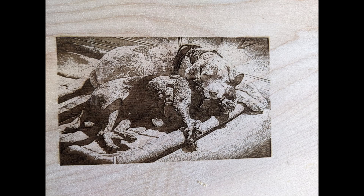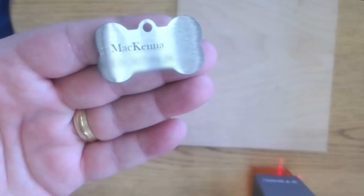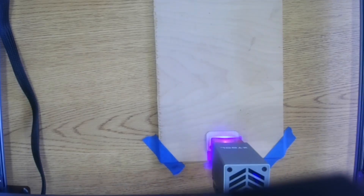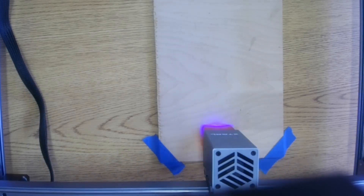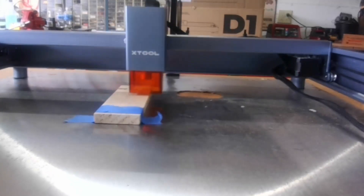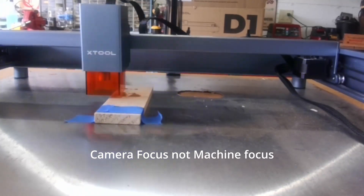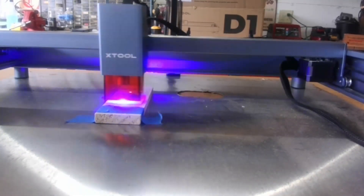You can see the amount of detail is pretty amazing for a 10-watt laser. It came with some samples, and I had a little issue with figuring out the framing, but here's some stainless steel which marked without any additional help. If you're doing other metals, you'll need to plan accordingly. Then just trying a wooden luggage tag — for how small this was, an incredible amount of detail popped out. Trying a thicker piece of wood, the focus went in and out as the machine was going, but showing that you can get much taller items in there, and that focus is really easy to get centered.